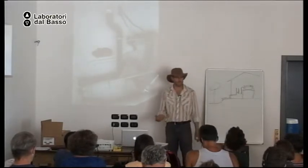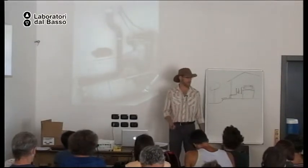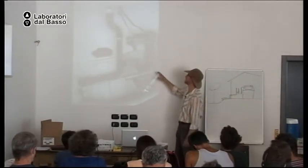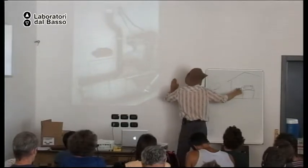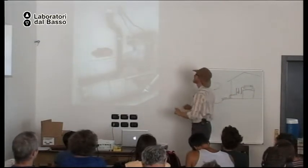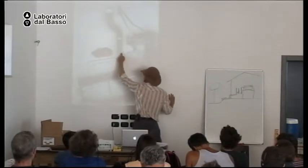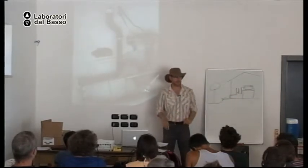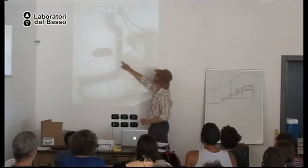So, usually we need to retrofit buildings in order to access the gray water. And here, not the clearest of photographs, there's a washing machine, just like there. Then there is a drain that goes into the wall for the sewer. But then a plumber put in this gray water drain so water could be sent to the landscape. And this is the drain, the P-trap.